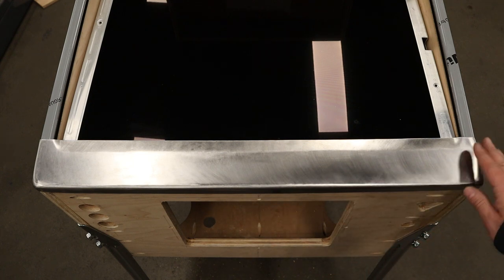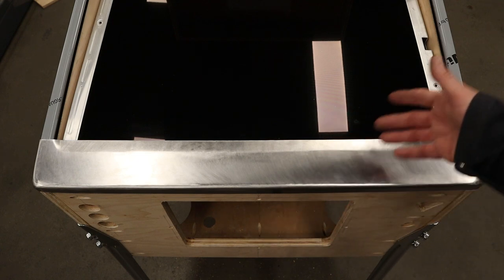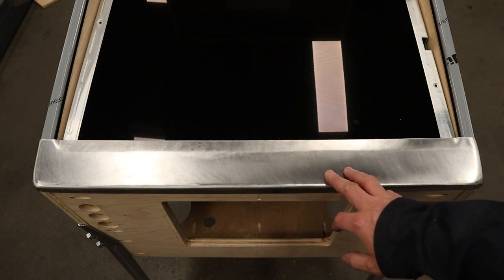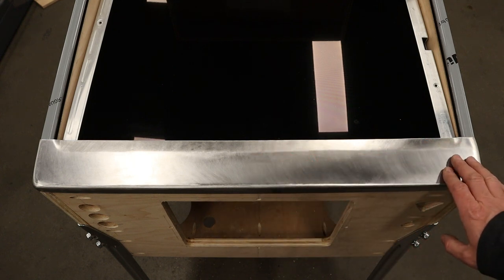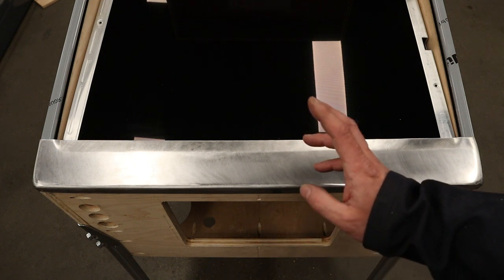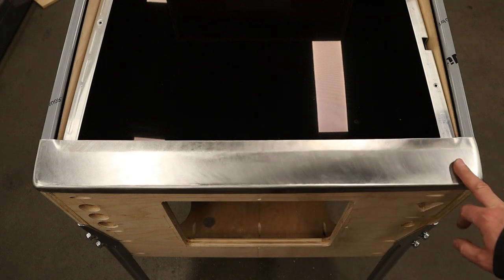You've got all kinds of options, and if there was no epoxy at all on this thing, I would say go to a powder coater, get them to powder coat this in the color you want, and what a great time to do all your side rails and your legs and your hinge on the side of the back box to get a themed look for your cabinet. However, I'm 99% sure that this JB Weld is not going to make it through a powder coating oven. It's probably just going to melt up and have problems. Now, you may want to speak to your local powder coater. They may have some kind of epoxy that's heat resistant, but as far as I know, that heat resistant epoxy is also less strong because it has ingredients in it to resist the heat. So if you're looking at powder coating, maybe look into that ahead of time before you epoxy it.